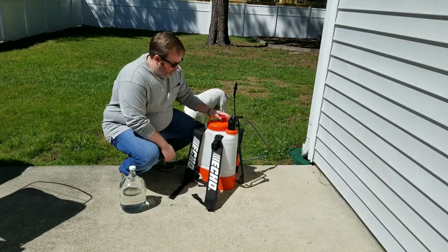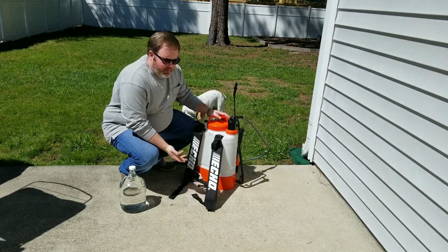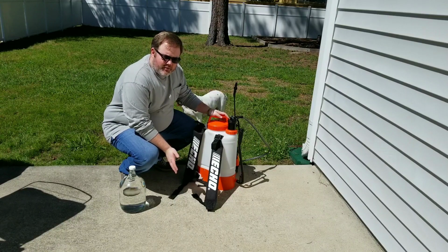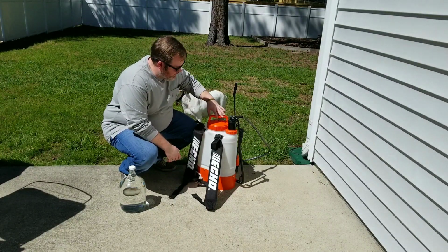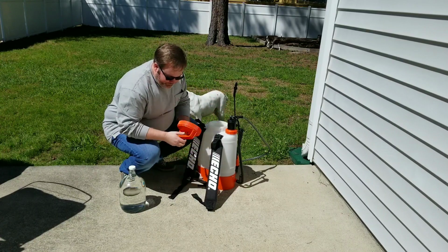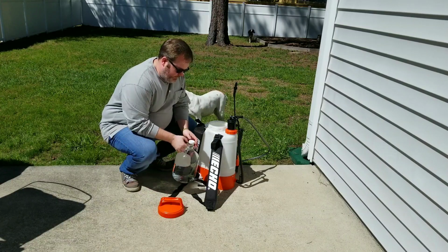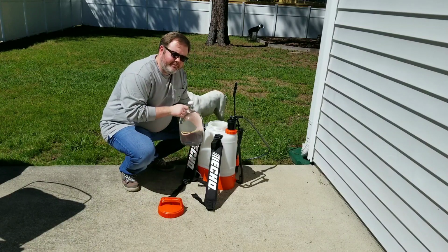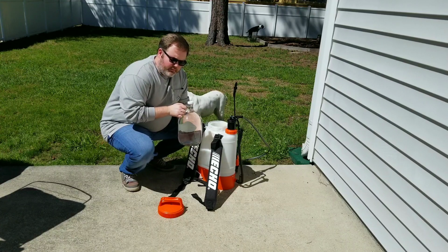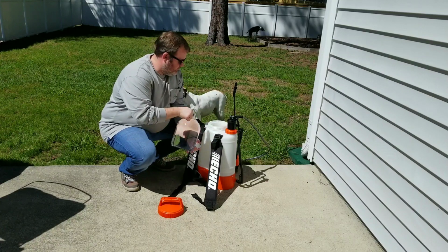Alright, so now that you have your backpack sprayer, or your spray put together, whatever you decide to go with, just remember, buy what you can afford. Don't try to break the bank on this stuff. You're going to undo it. You're going to get the flow rate, you're going to take a known volume of water. So in this case, a gallon. We're going to pour it in.